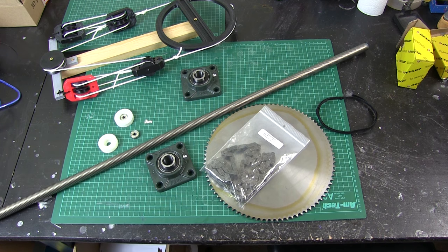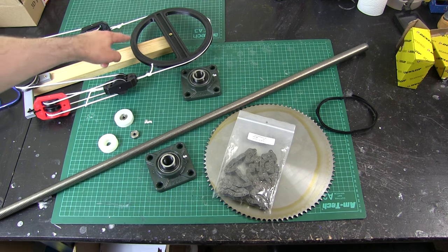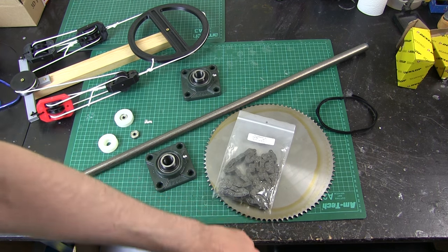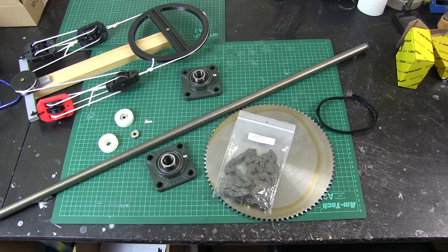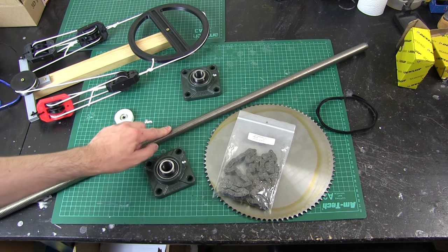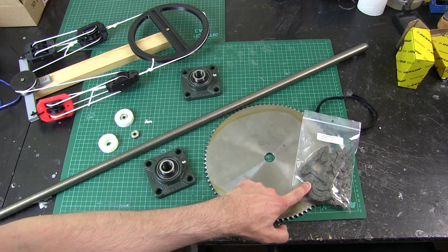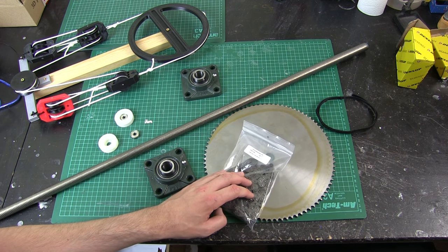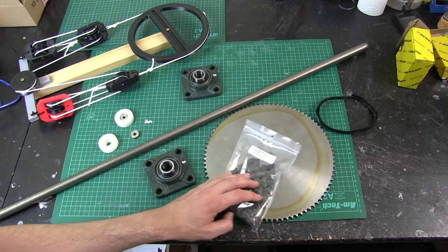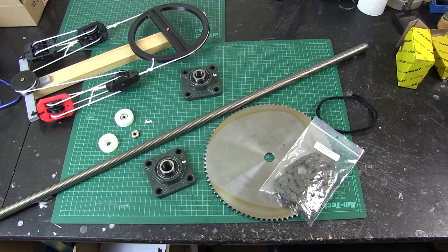You'll notice quite a lot of metal on the table. That's my big sprocket and my chain that goes on it — that will replace the main output, so that will have effectively the elbow attached. It'll be running on a 20mm studding piece which is going to be the main upper arm. It already comes with a 20mm hole in it. These came from gearsandsprockets.co.uk, run by technobots.com. This particular one is an 06B 3/8 of an inch sprocket and chain — a fairly hefty one. It's nearly a ton breaking strain on that chain, so that should be fine for the main axis outputs.